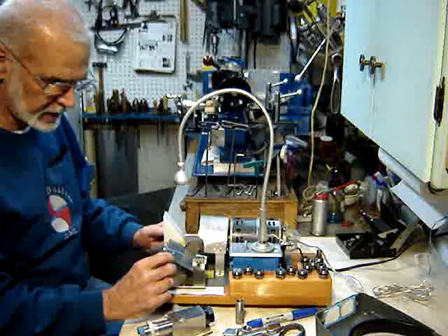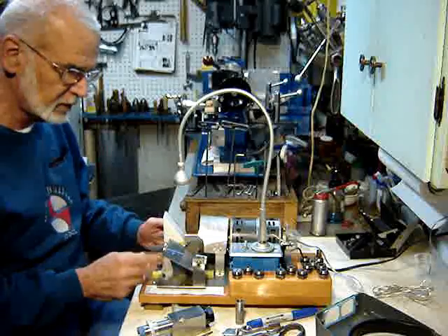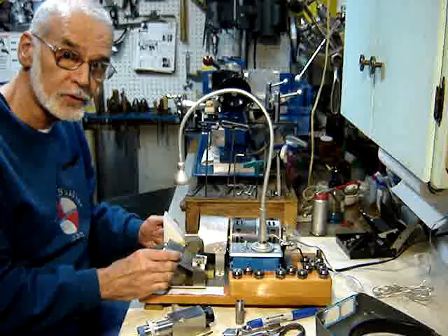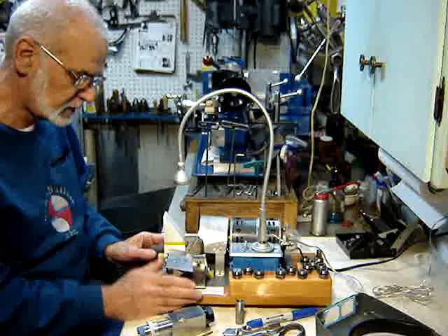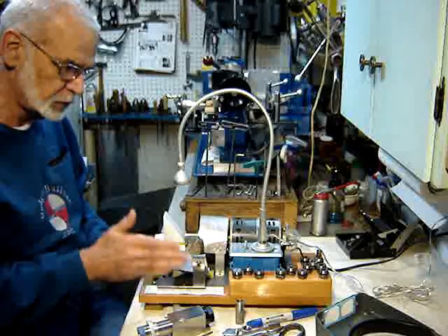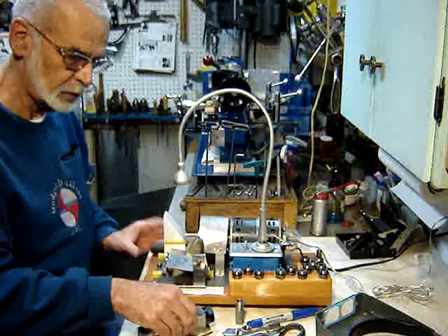The secondary facet angle is set by lifting the table so this little triangle drops down. The same angle is used for all secondary facets. Traverse past the grinding wheel is handled with this little lever here that just moves the drill past the wheel.